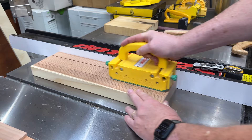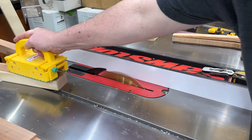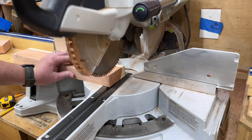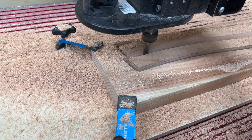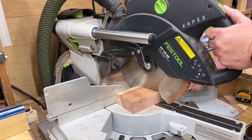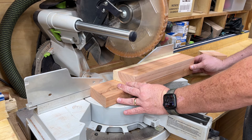Remember, if you get the paper templates you still need to have the plans. The paper templates are only good for the curves — you wouldn't find any straight parts on them, because it's quicker to cut those on your table saw and chop them to length on the chop saw. Now we're cutting out the front seat slat. These are slanted on both sides because the chair tapers toward the back. Our CNC is still cutting in the background — it takes probably an hour and a half to cut all the curves on a standard two-foot by four-foot CNC machine. I tried a half-inch cutting bit but it's no faster than a quarter-inch bit, so I wouldn't advise going that route — just more sawdust with no speed gain.